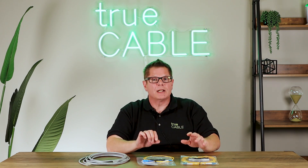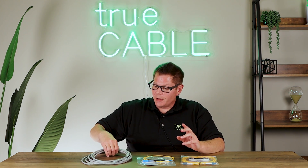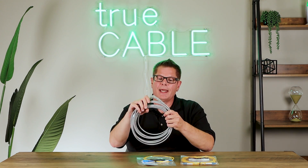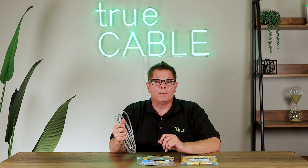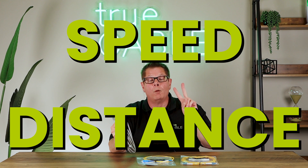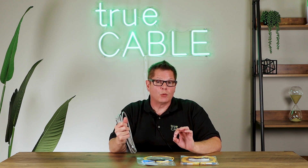So the purpose of this video is: when is copper not enough? If you've worked with Ethernet cable for some time, you're familiar with the nice thick copper Ethernet cable. Copper has been around for a long time and it's not going to go away anytime soon. But there are times when copper Ethernet cable doesn't cut the mustard anymore, and that usually comes in terms of speed or distance, or more importantly, speed over distance. That is going to be the biggest factor in your decision as to whether or not to run fiber.